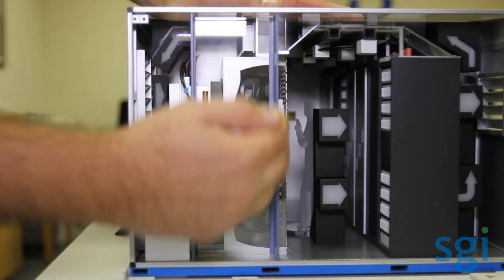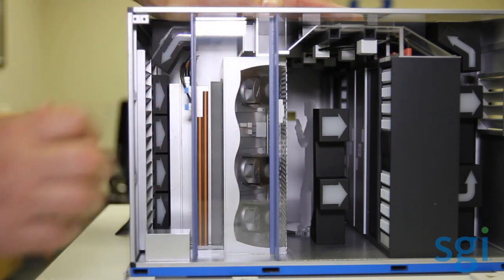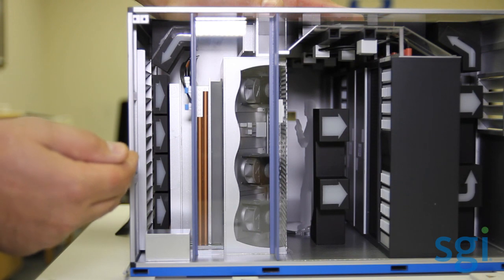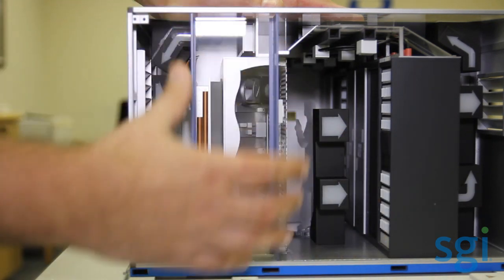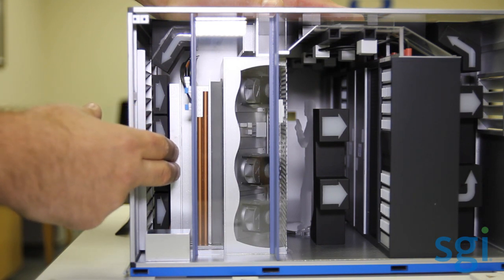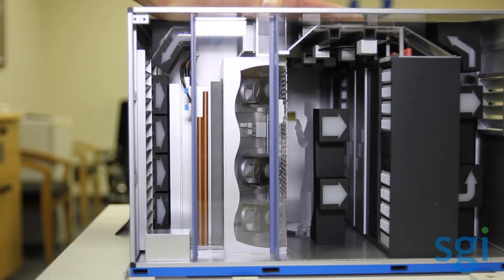I'm going to remove a couple of these units. What you have here is an expansion unit. This entire section from my hand to the outside is the cooling compartment — this is where all of the cooling and or heating required to keep the devices at the proper temperature and humidity is done through this separate compartment. The servers and hardware devices are well away from the outside air. In the cooling compartment, from the outside in, are the filters. The filter system can support from MERV 5 up to MERV 16, or any specific type of filtration a customer requires.